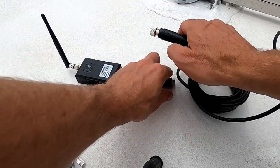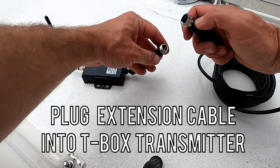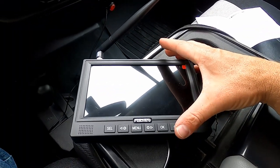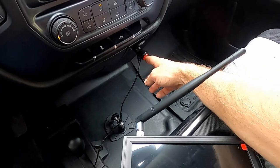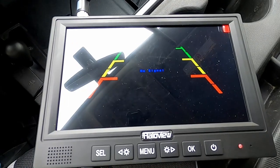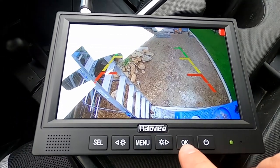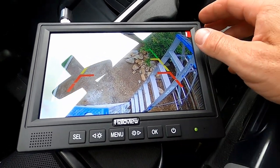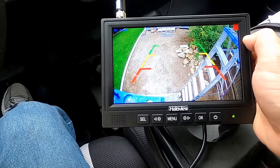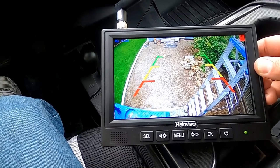Now I have the camera installed and need to get the power hooked up. I took off the light cover — you can see wire nuts with crimp connectors. The positive red wire goes to the green wires, and the black wire goes to the white wires. The wire came pre-soldered, but I want to test it first before making a permanent connection. I connect the receiver, which hooks up the camera and power running to the antenna, then test it. Wow — it came right up and I didn't even have to pair it, and it has sound!